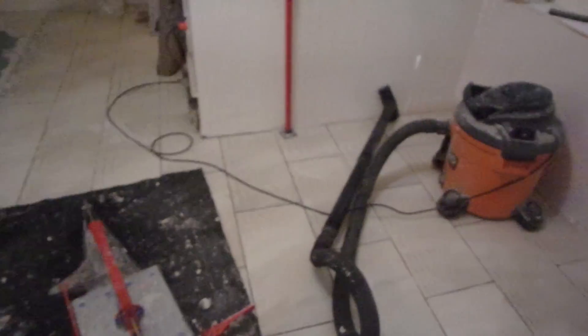Because it's under 20 feet, I didn't do that. Around the perimeter, for expansion and contraction, don't cut it tight — the baseboard will cover that gap. Leave a little gap, don't cut it tight to the wall so the floor can expand and contract. That's true for every tile installation you do. You need to always leave room, including around here and under the door jamb.